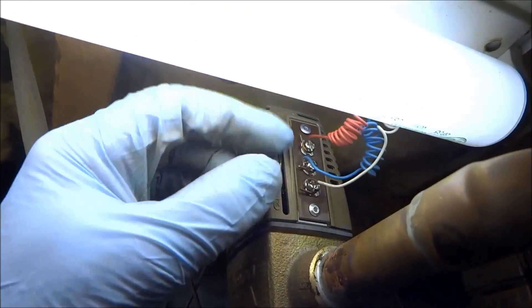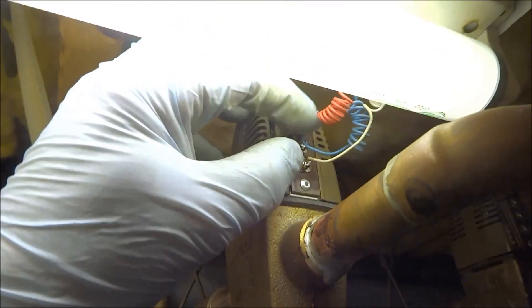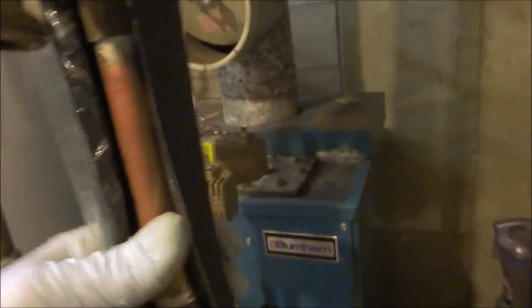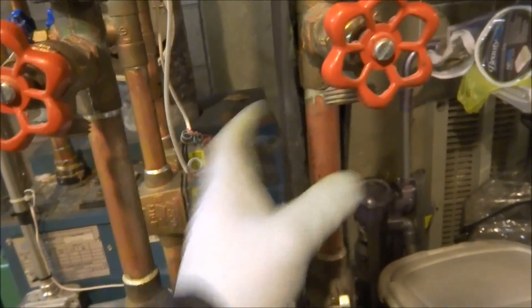When I came here yesterday I flicked this lever on the old head and it shut off — that's why I just changed the head and the thermostat upstairs yesterday. But sometimes you have to get into them deeper; that's what happened today. It's coming back warm — oh, it's working good now! This is the first floor zone up there that I had turned up. Just making sure all the zones are coming back nice and toasty because they're all calling — they're all coming back warm.